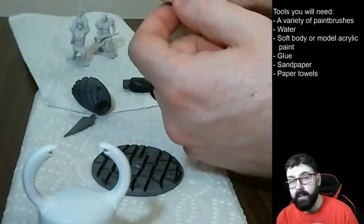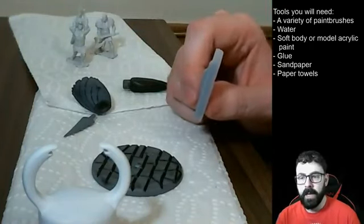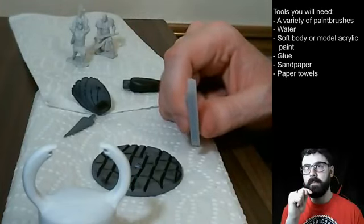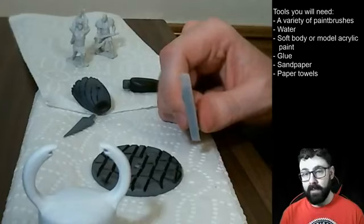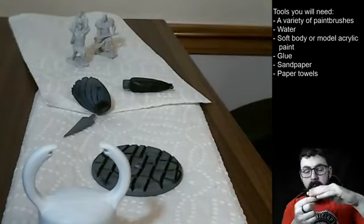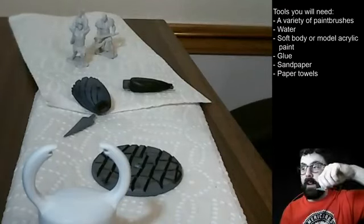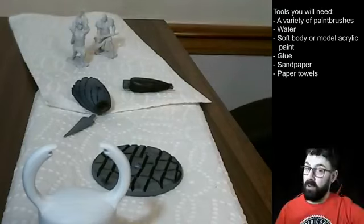So I have a resin 3D printer, which prints a little bit different than what you maybe know of with the filament ones. A filament 3D printer, you almost think like a glue gun. It's like a plastic filament that feeds through a nozzle that melts into the place where it needs to be. Mine's different in that mine is resin, so when it prints, it's actually a table or a bed that dips down into a vat of resin and then slowly pulls out the object because there is a light from underneath that is flash curing the resin. So it's just slowly pulling an object out of the resin. It's kind of cool to watch.